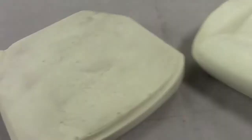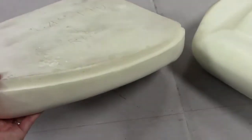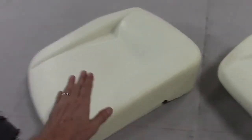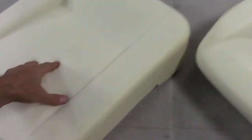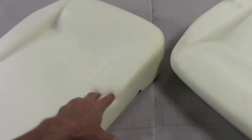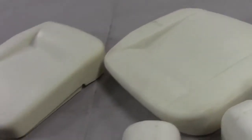We also manufacture the molded cushion and headrest foams in urethane foam. This is from our own tooling. We are very proud of the quality and the feel, the density of the foam. We get this exactly right and get great results that you can see on our webpage.